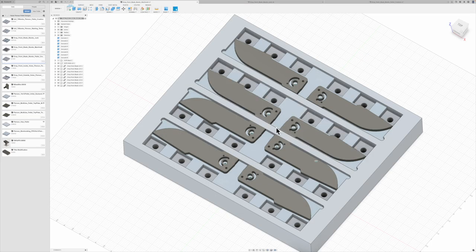This is what I ended up with. I finally realized that if I don't try putting clamps in the middle of the pallet, then I can stay away from the zone that I need to stay away from, and I put my pieces back to back in there. I don't end up with any white space, and I was still able to get my 8 parts on here, with 3 clamps on each one of them, able to get in between to do the machining on this radius right here that I need to, so I can get between my blades, with good clamping power. I think this is going to be a good pallet design.